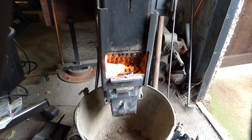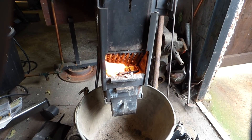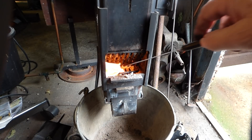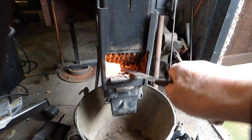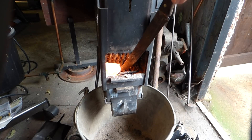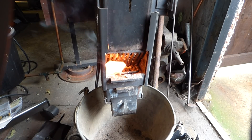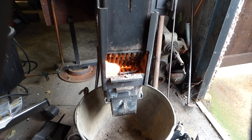If you're having a draft problem with my design, it's only because your chimney is not high enough. You need, for this particular fire, a three-metre chimney. I hope that answers some of your questions. It doesn't like the door being open when I start it.